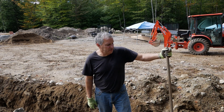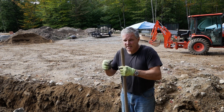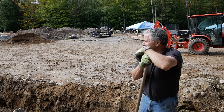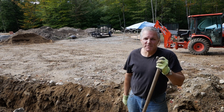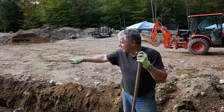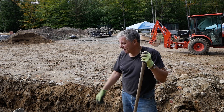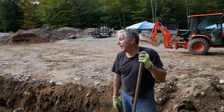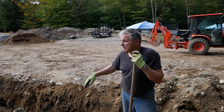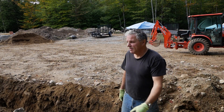What Kathy and I have decided to do with this trench is backfill it all in sand — nice clean sand to protect the gas line from all the rocks we have here. We're going to use some of the leftover foam that we pulled down from the interior of the shell and just layer it right on top of the soil. That way it adds another layer of protection from the rocks that are going to be dumped over here. And because we're going to drive over it — it's our driveway basically, and there will still be cement trucks coming through — this adds protection and gets rid of some foam in the process, which is a win-win.